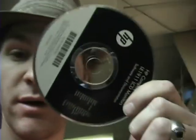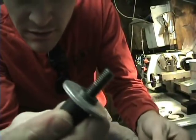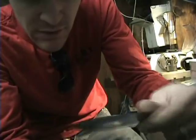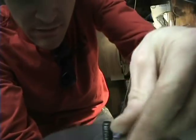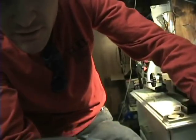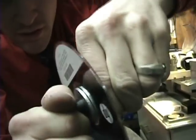I'm making some cores for a project and I do not have any cores to wrap my coils around. What I got here is a CD. I made this thing — I machined these little parts on the lathe. This is a washer, and this CD fits right on top. Then this washer fits on top so everything is nice and snug, and this one fits on there. See how that fits? Then this gets threaded onto here — hand tighten that.